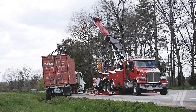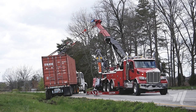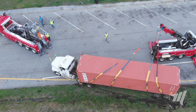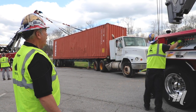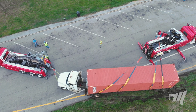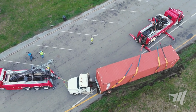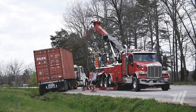All Paul's doing is a slow rotation — he really isn't running the winch line very much at all. If Mike takes the boom and runs it out, he can actually pick that tractor up and bring it more square to the back of the truck. You can see it's just quabbling a little bit. If he stops with the low line and just booms out, it'll pick it up and swing it right to the back of the 90-55. You can see it's out on level ground right now. The tractor's stable and the trailer's stable. The tractor is out in back of the 90-55. Paul's letting the 1150 down. The back tires are up on the apron. We've got the scenario where the tractor and trailer is out here on the road, and all the weight is back off that low side so it's stable.